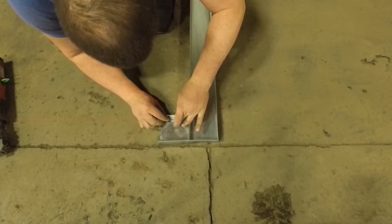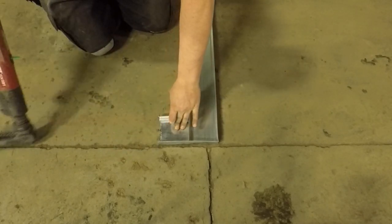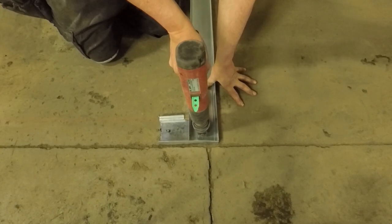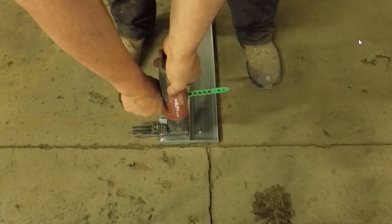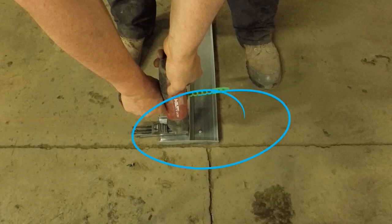There's a beautiful corner—that is a door corner. As long as you understand that we have to tie everything in, it makes it very strong when all these systems are overlapping and tied in together. One shot in each side to get it straight. It's important to know: you do not put a full piece one way and then overlap it the other way with the drywall going in that direction. You always do it the other way—it's stronger for the door's sake.